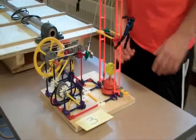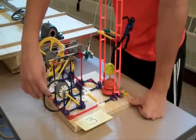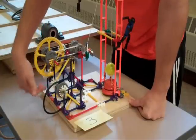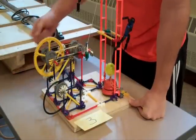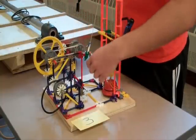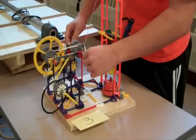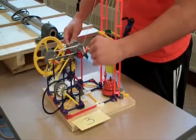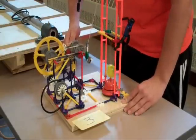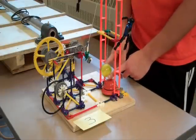Our design involves this ball ringing this bell every couple of cycles. It starts here with the belt that turns this little wheel, turns the shaft, which turns the smaller gear, which turns the bigger gear, which is connected to these two rubber band belts, which transfers the rotation to this arm here. It isn't fixed — it actually rotates on the shaft — but every time this little arm comes around it pushes the arm around, transfers the motion to the string, to the ball, which is connected by rubber bands.